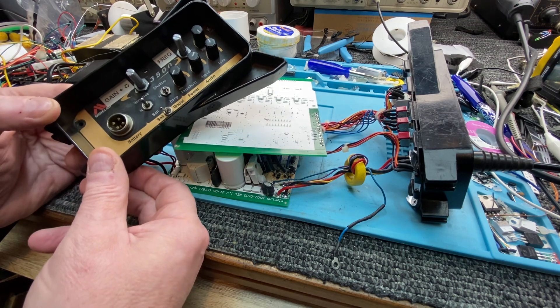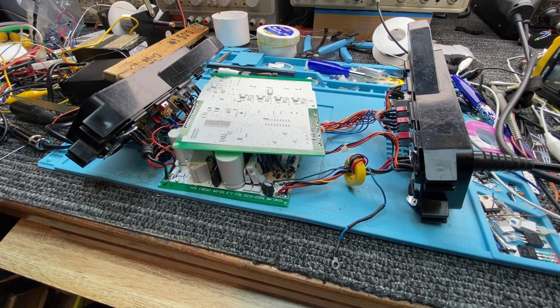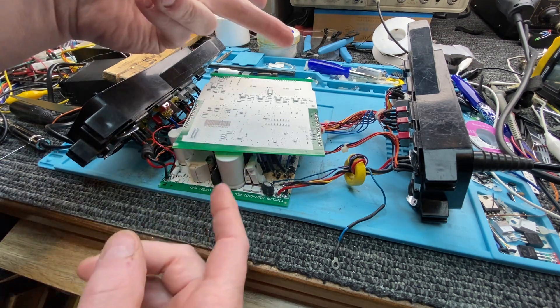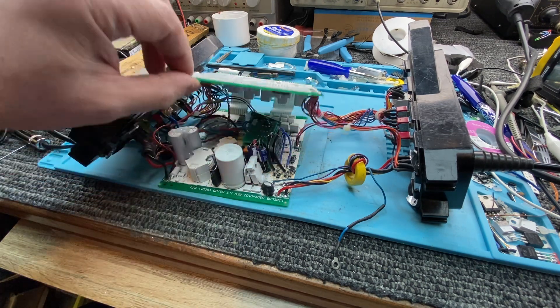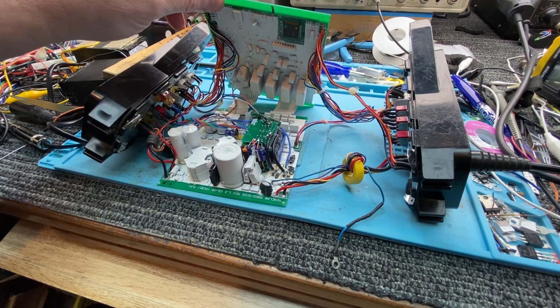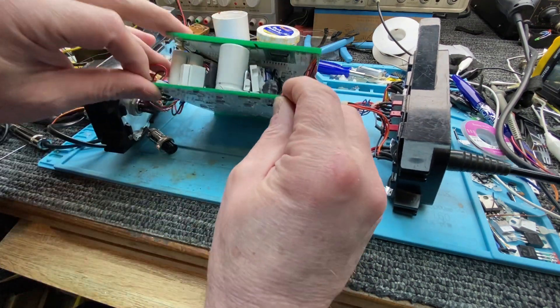On these detectors, the first MOSFET on the input stage of the receiver is an N-channel MOSFET — a high voltage one. It's very difficult to get P-channels in high voltage. If you did use P-channels, you'd have to invert the negative-switched transmit into positive-switched transmit, so it goes opposite to whatever polarity the transmitter is doing. These switch negative, and you want the right polarity to block the flyback pulse — just depends how you've got the thing configured. We have an N-channel, which is on this side of the board.